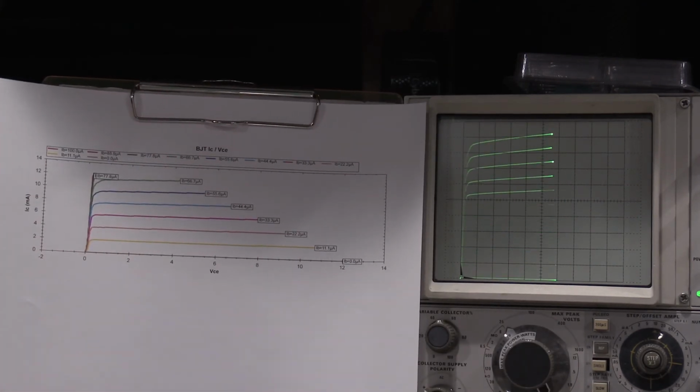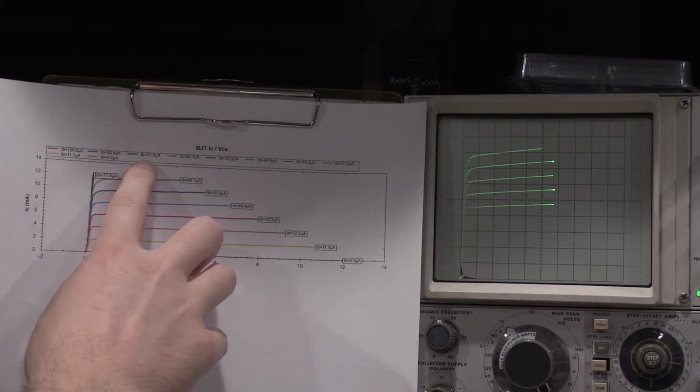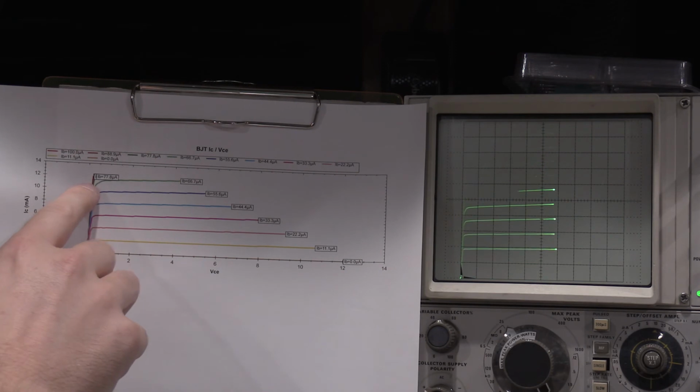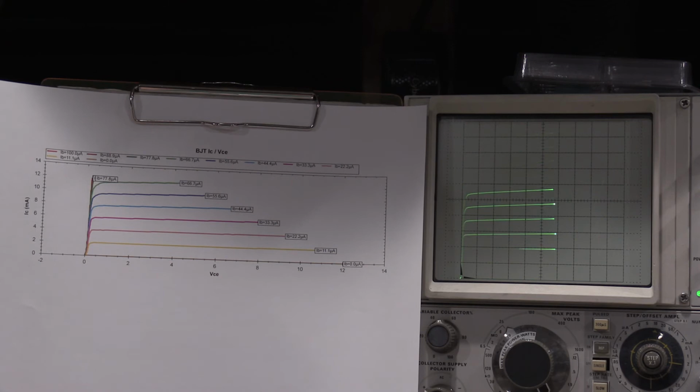We ran 10 curves. Now on this one, the initial 3, they just saturated the transistor. The transistor just turned fully on and didn't do anything. But yeah, you actually have a little bit more sensitivity in the 577 than the DCA Pro.